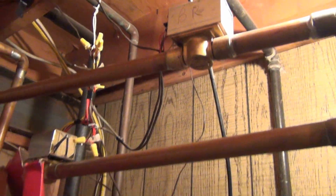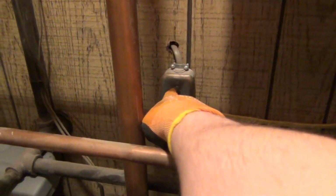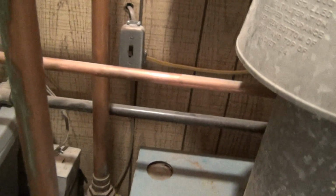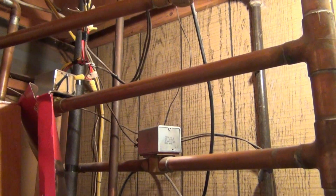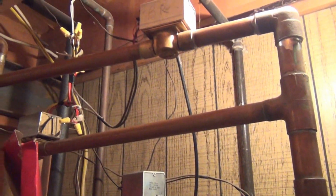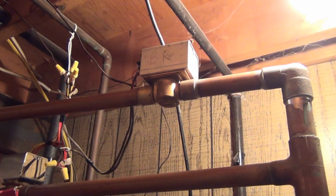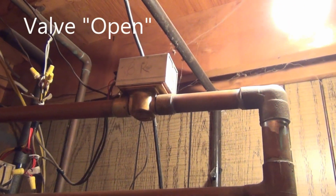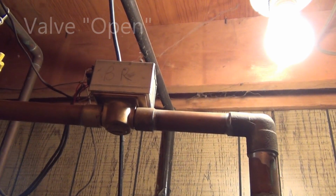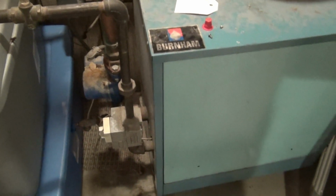But essentially, there's a 24 volt transformer in this guy here off of the 110. So first you shut off the furnace. That's my power supply. And here are the zone valves return. The 24 volt goes up to the thermostat, and whenever the temperature gets to the low level, that will close the switch, and then it will make the valve open, and it'll hit a limit, and that limit will then turn on the circulating pump, and it will also turn on the burners.